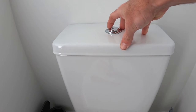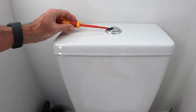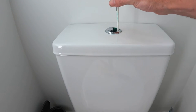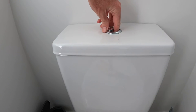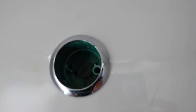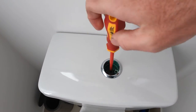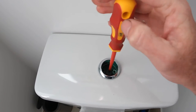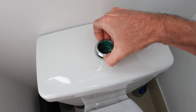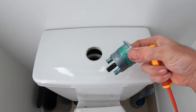We can do a flush and another flush to get as much water out of the system as possible. It's not the end of the world because when you pull the mechanism out it flushes anyway. Screwdriver in on that little lip lifts the big button up - put that down there. Then pull the little half flush button and you can see down in there a Phillips screw which I'll undo with the flat blade. This holding screw holds the top cap into the lid of the cistern.